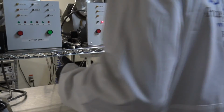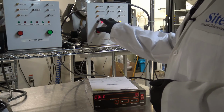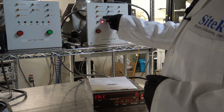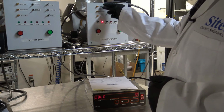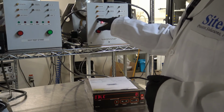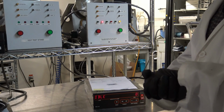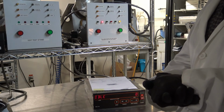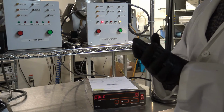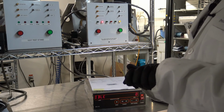So I'm going to explain this test head assembly. It's similar, but there's a difference. We have our solenoid valves. There's no front faceplate indicator because this is not an ST. This would be for an S model SRD. We have our anti-static, our bowl heater, then our N2 heater in the same spot. But the anti-static instead of the front panel is the main difference on our test head here and between the tools. So our cycle is going to be a 30-second rinse, 10-second purge, 30-second high RPM dry, and 30-second low RPM dry 2. Let's go ahead and begin.